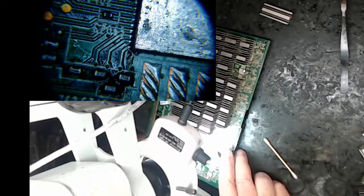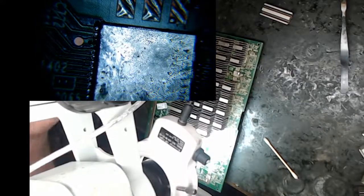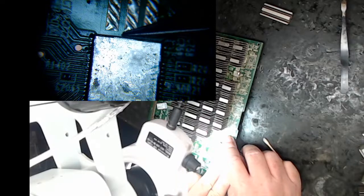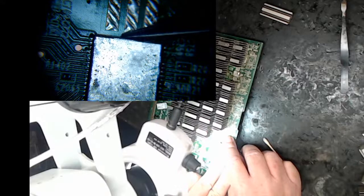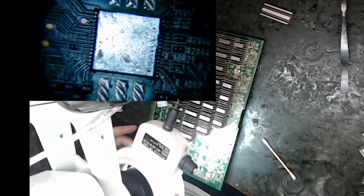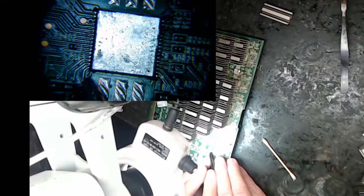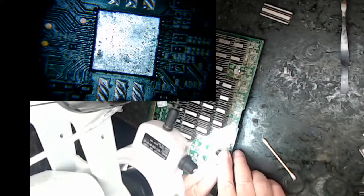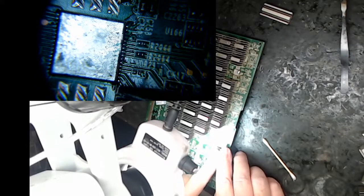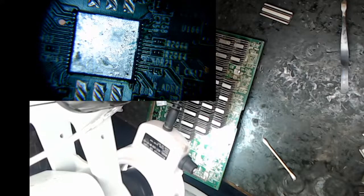And then this guy. I'm not real happy with this one right now because the edge of the chip goes right by it. So I've got this chip too high, basically, on both these. So I'm going to bring it down some. We'll reposition it until I'm happy with how this goes. Hopefully if those things don't catch, I can just move it down slightly. Okay, let's take a look at that now. Hold on, I'll get it. I'm looking at this white line down here, making sure it's parallel to the edge of the chip. So I like that, and I like that. Let's pay attention to this side, because it could still be cockeyed. This seems a little cockeyed right now, but I think it's probably okay. And as far as my reflection goes, it looks like I'm fairly centered in the chip.